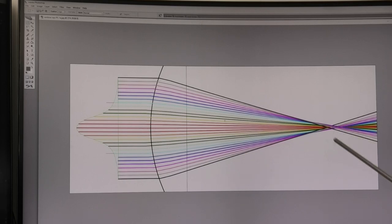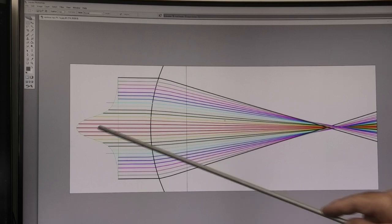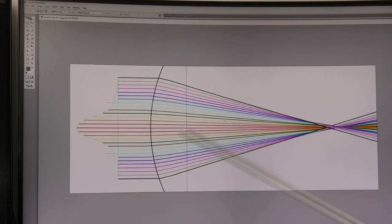This may be something that the manufacturer would call the optical focal point, but that's not what we're interested in. We do damage with red rays, and the red rays are focusing at a different point to the general optical focal point, which is why we found that we were getting a damage profile which was 5 or 6 millimetres beyond what the manufacturer said.